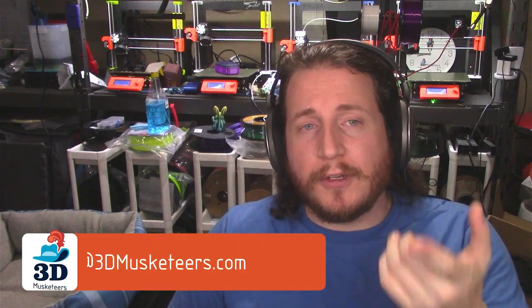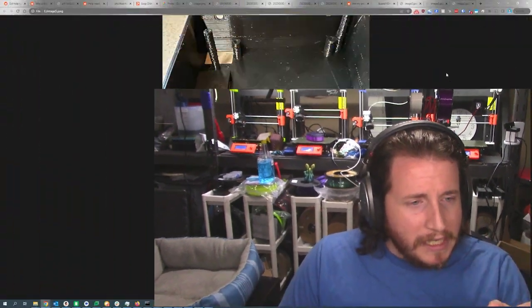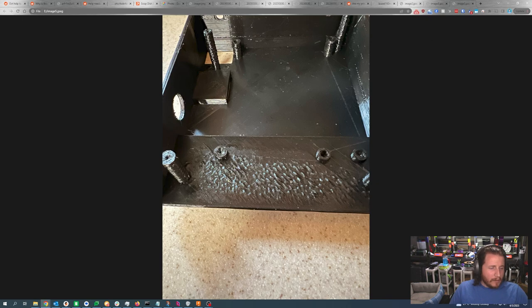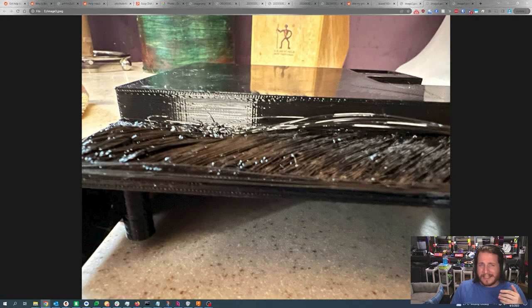We've got a fail from fan Rick, who sent in his failure via email. This is PETG — Rick's been doing some work on his printer with a new SKR board, but he's having an issue with supports and bridging. You can see some really bad bridging on the part itself as well as rough top layers. Being PETG, it is much pickier than PLA, and a lot of this comes down to cooling. I would just have all of this be supported rather than trying to bridge it over thin air. They're using SuperSlicer — snug supports should take care of this no problem.